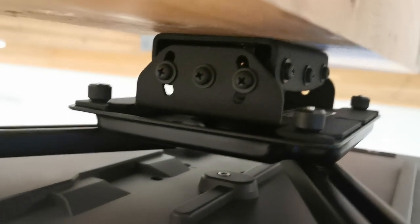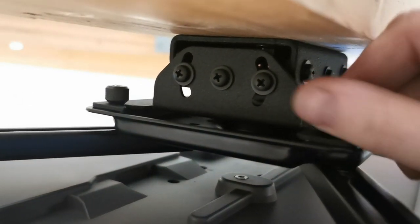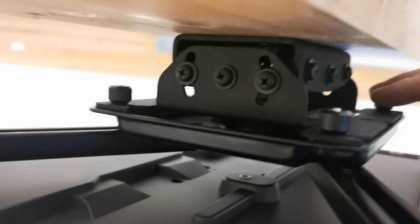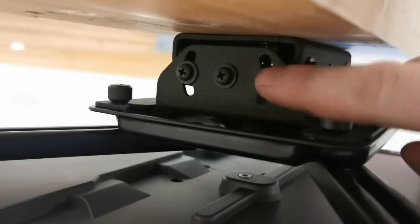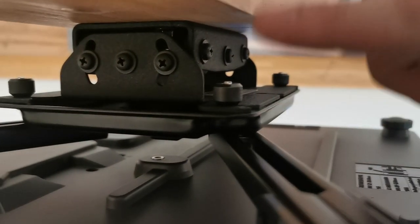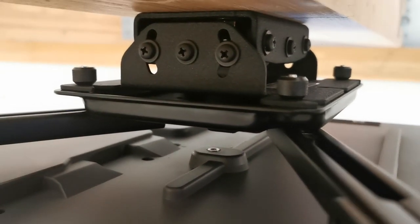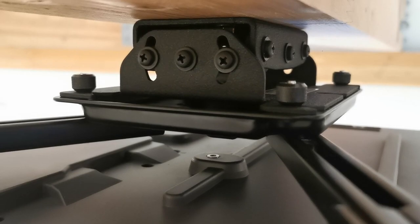So that's how you install this projector mount. Just make sure you crank these nice and tight. From there, fire it up. Make sure you put your level on here and make sure it's balanced on all corners — balance it this way and that way — then tighten your screws up so it won't lose it. From there you can do the rest of your adjustment through the projector, through the lens shift.